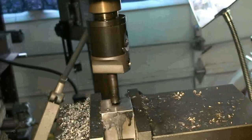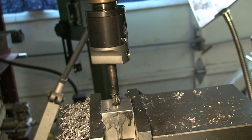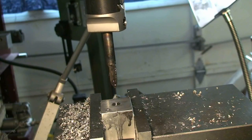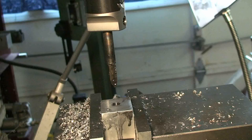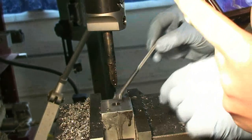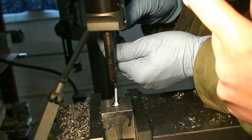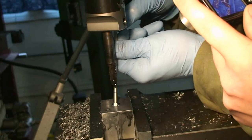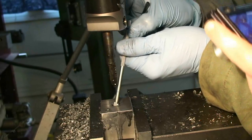I'm going to turn on my digital readout up top so that I can get it back exactly where we started. Now I can see inside the hole and see where the base of the bullet is going to be. I'm going to use my expanding T-gauge to measure that. We'll take several measurements — lock that in there and bring it out.